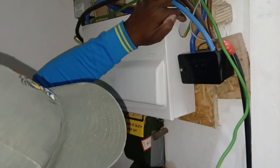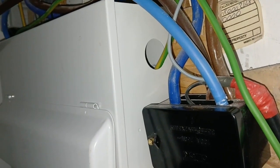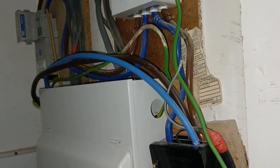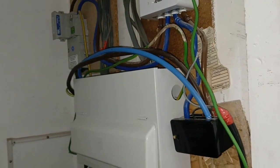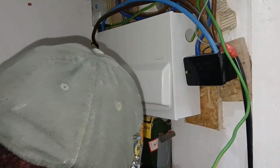What happened here is this is open. We call this a C1. It's a potential for immediate danger, really. Somebody pushes their fingers in there, they can have a nasty shock. So we're going to fill that.